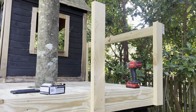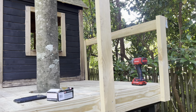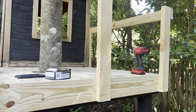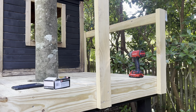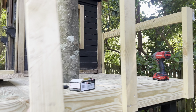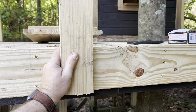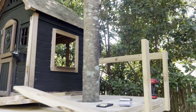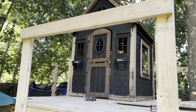For the safety railing, we're doing it at about 24 inches tall. To account for the extra length on the joist header, you cut the pieces at about 30 and a half inches. Then run a 2x4 across the top, and if you'd like, you can also run a rope through the middle — which we're doing in certain sections.